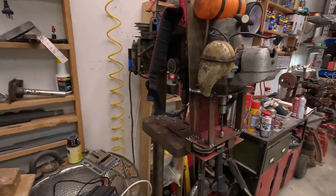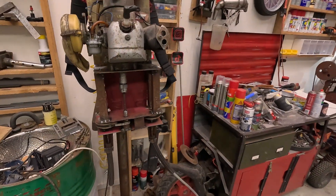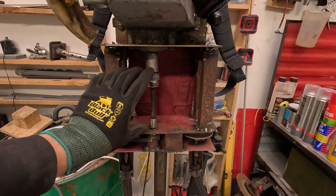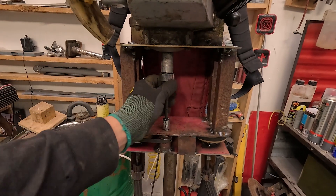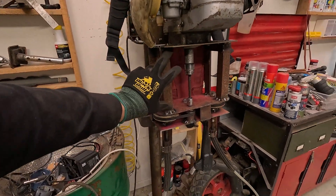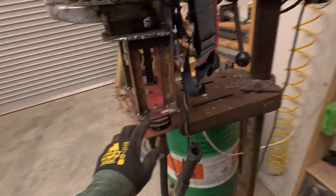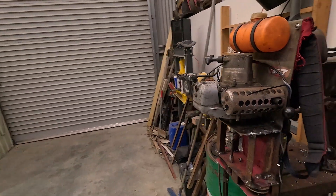Let's take a look at this — it's all together. I'm fairly confident in this design. I managed to get that spindle there quite true — I put it in the lathe and gave it a tap with a hammer after welding it. There's still a bit of play in there just in case it needs to flex. The reason this is so long is because the drive cables are too short, so I had to make up the extra length here. But it actually fits alright because the backpack goes right down to the bottom.